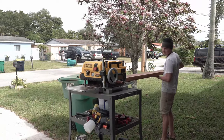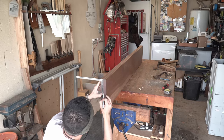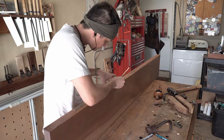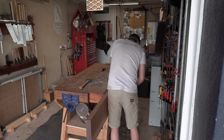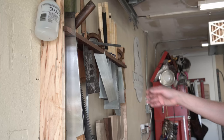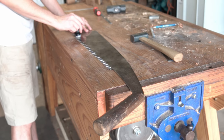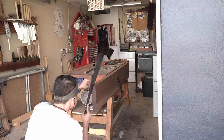I've got a client and friend who I've made some pieces for, who really appreciates my artistry. Back at the start of the year, after I got rid of my table saw but before my new bandsaw arrived, I decided to try and use a hundred-year-old mebiki — a type of rip saw — to resaw this piece of mahogany by hand to form the tabletop and majority of the components for a small hall table. I'm sure a bunch of folks will say, I bet that thing isn't sharp. And that's where you would be wrong, because immediately before receiving this saw, it had undergone metate from one of the finest in Japan. Long story short, kobiki-style work is just slow and back-breaking work.